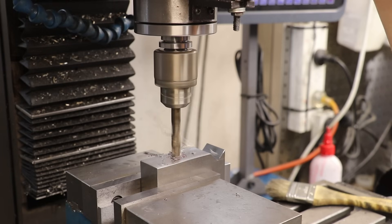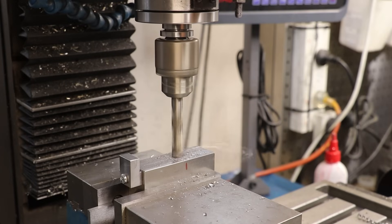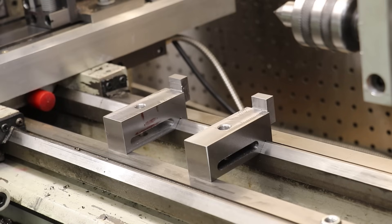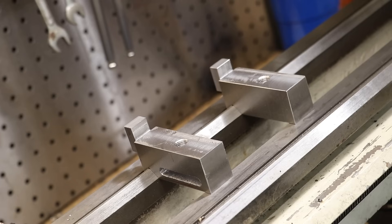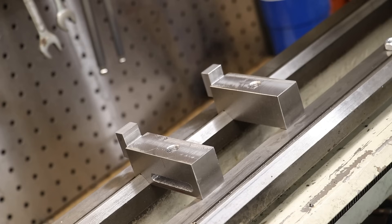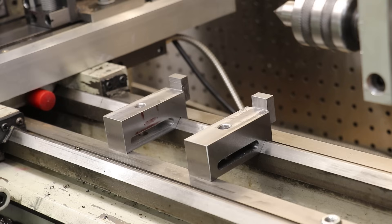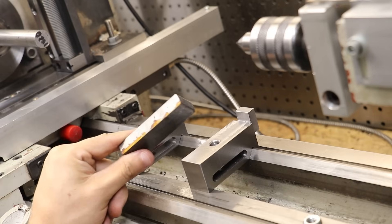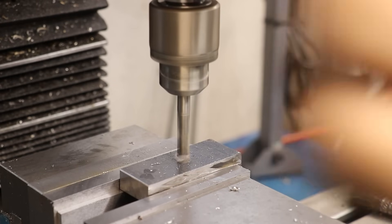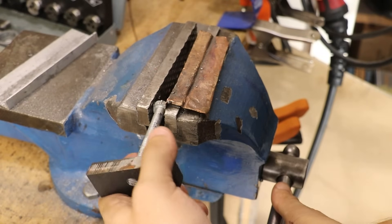I'll also make a hole through the bottom and I'll also drill and tap the top. Alright, and that's pretty much how those are going to look. As it turns out, probably not as complicated as I originally thought. Now for the front one, I did come in and go all the way through it and this is just so I can have easier access with the spanner — easier to come in through the outside than having to go through the middle. Now yes there isn't a whole lot of steel on the bottom, but the clamping on this shouldn't have to be all that tight. The next thing that I need to do is make the clamping plate, and once again I'm using some off cuts which are roughly the correct size. Now for tapping the hole, I'll go most of the way, but I'm not going to tap the whole way through. Doing this means I don't have to use Loctite to hold the bolt in place.